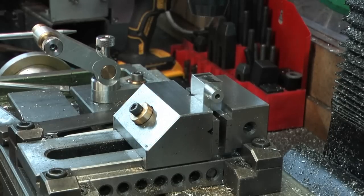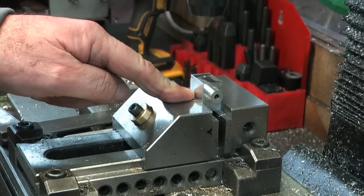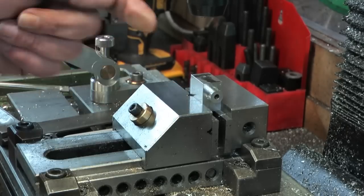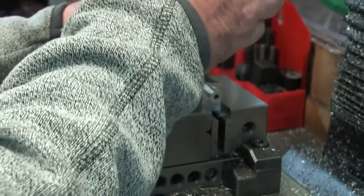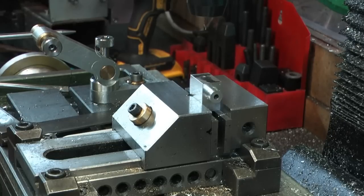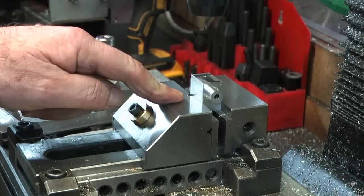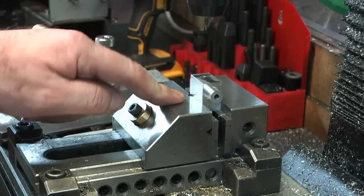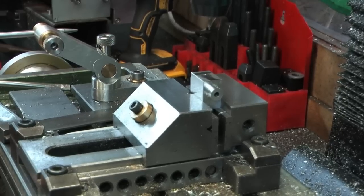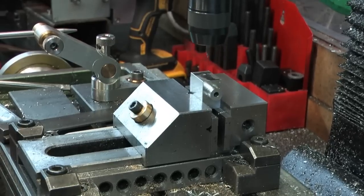I suppose every project builds you a mount of stock and tooling. I'm going to move along to the next hole - not a problem. Centre drill back in. So the next hole: that was at zero - the next hole is 5.5mm back. That's the centre between the two butterflies. 5.5 - that should line up on that line, yes it does. That's a good sign. Speed that up a bit.